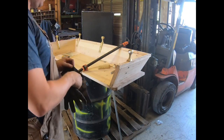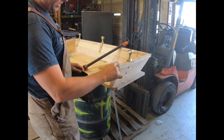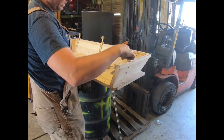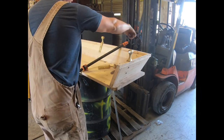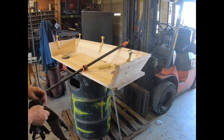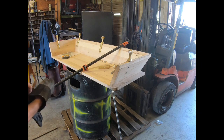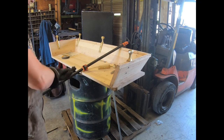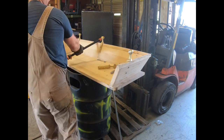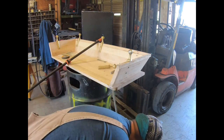Made the third bend. So we've got our loop here, 6-inch pipe. Then we took a 3-inch piece, made this here a little more of a sweeping curve. And then we did a hard 90 there with 1.25 inches. And so you've got three different bends here. So we're going to dry fit it now and see how close it is. Sure, we'll have to tweak it a little bit.